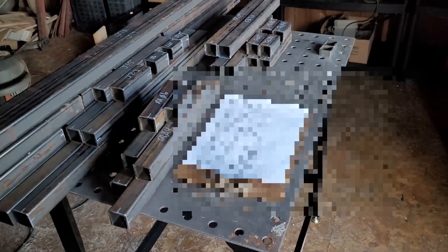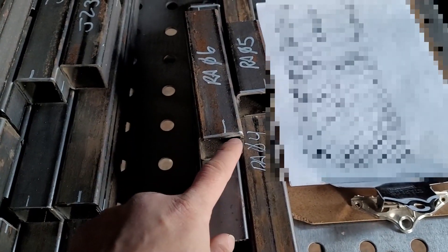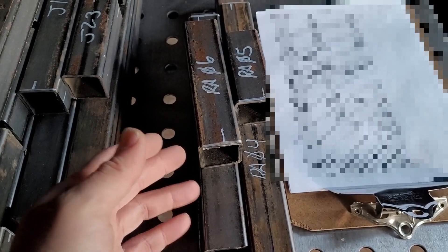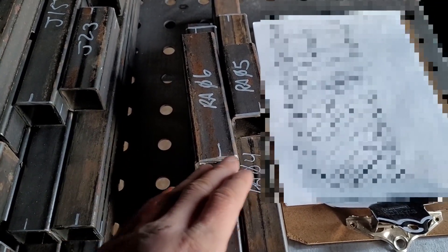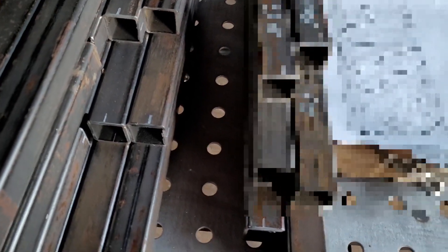Overall cutting isn't too bad with a cutting disc. Just go slow, follow the line, and make your score first with the cutting wheel — it's a lot easier to correct that than to correct the full cut. Once you have all four edges scored, go ahead and make the full cut. Don't go all the way through in one pass; cut as far as you can, flip the piece, and cut through again for all sides. It's still not perfect but it gets the edges pretty straight.